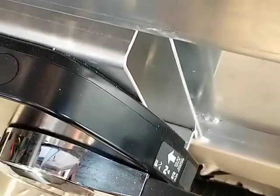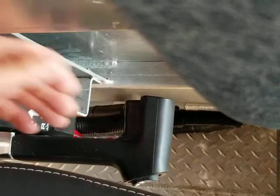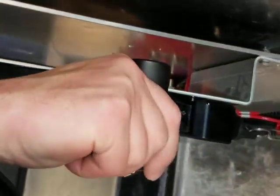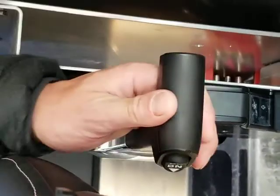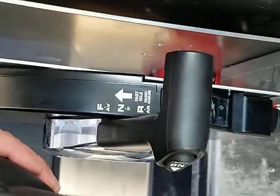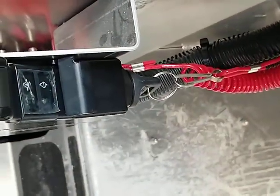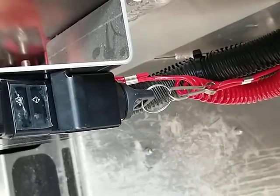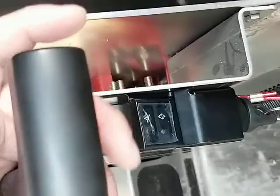The control for the kicker engine is down low by the driver's helm. The kicker engine on this boat is connected with a tie bar to the main engine, so you can use the steering wheel to control the kicker. The tilt for the kicker is on the side of the controller, so before starting it you'd want to make sure it's all the way in the down position. To shift it, press in the button and that allows you to move the shifter. The shifter must be in neutral before the system will allow the engine to start. If you have any trouble getting the kicker to start, just run it reverse, forward, and find the neutral detent again — that will usually allow it to start. The key for the kicker is down low; to start the engine just twist that. No choke is needed — the engine's brain will automatically adjust for fuel and air ratios. To shut it off, turn the key back the other way, and always make sure to tilt the kicker engine up before running off the main engine.